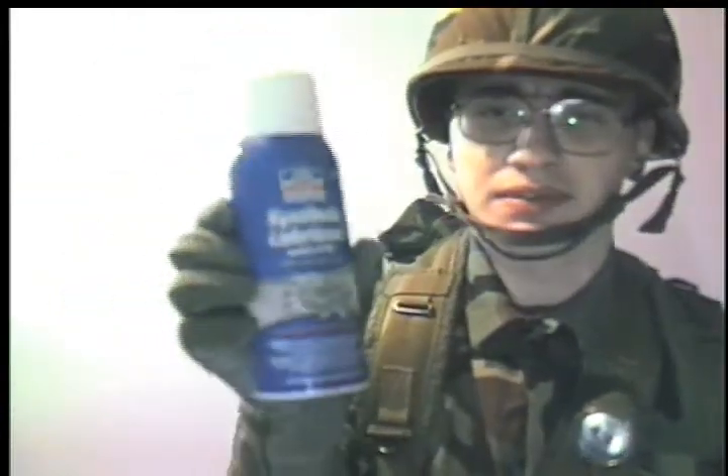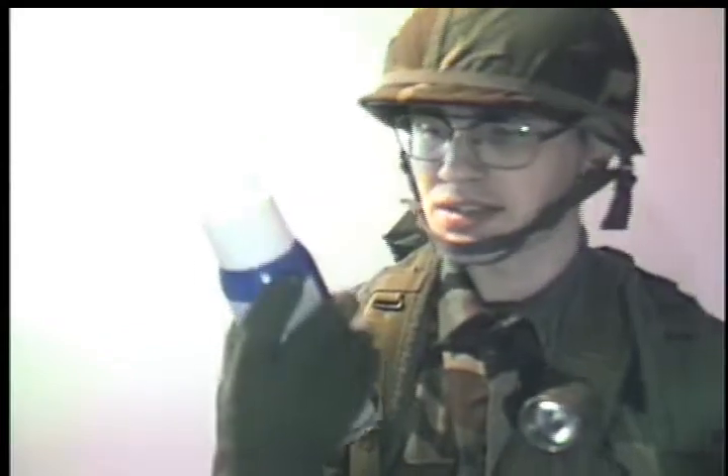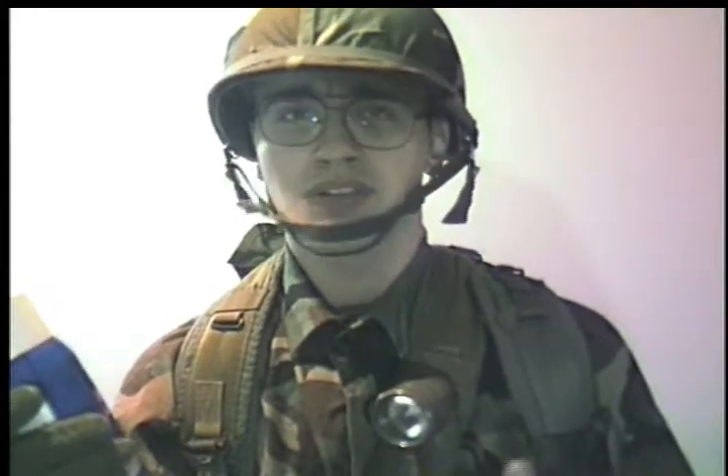As an example, this is a Permatex lubricant with PTFE — I think it's a grease-based lubricant, but it's not quite what I'm talking about. I don't actually have any silicone oil or spray products; I threw those out a long time ago. But I wouldn't even use this — it's just a spray-on solution. It's not a grease; it doesn't have the staying power or the base oil viscosity needed to adequately protect the parts. You can throw this in the trash.